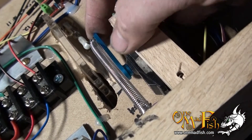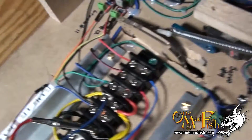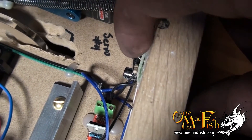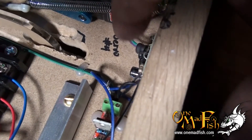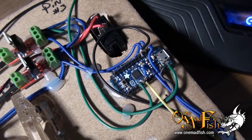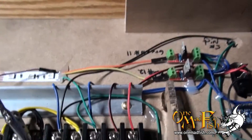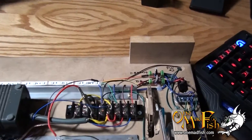I had to add a spring because with the long throw arm I needed a little bit of extra tension. It also works on 5 volts, so I needed a 12-volt to 5-volt converter — basically an old car charger for an iPod touch — so the servo runs off 5 volts. It's only 500 milliamps, which is eh. Everything is controlled by the Arduino; I'm going to be replacing it with an Arduino Mini. Right now this is the Trinket Pro from Adafruit. I think I fried a pin or two and need more pins. This is iteration number one — I'm going to be revamping it, cleaning up the wiring. That is my automatic bender up close and personal.